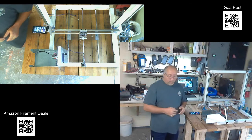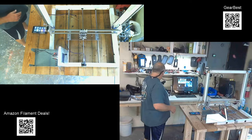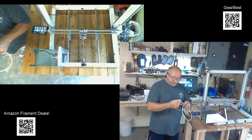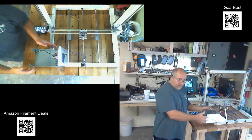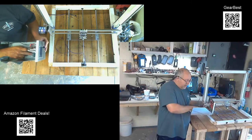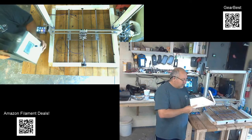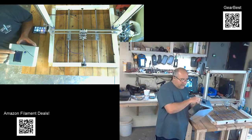So what I ended up doing was I had some small poly tubing and I clipped off little standoffs out of that tubing. And then I took M3 screws and ran through the sheet metal and then put the standoff on there out of that tubing, and then the board, and then an M3 nut. And everything is good and clear. Nothing's touching the metal. It's solid as a rock, and it worked out good. The spacing, I got the spacing pretty good on my display here.